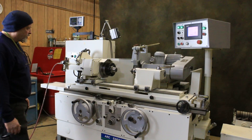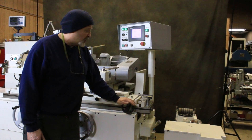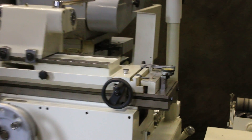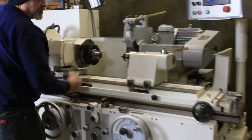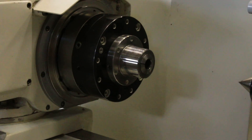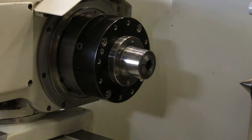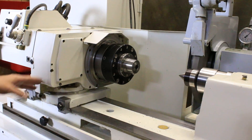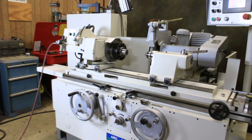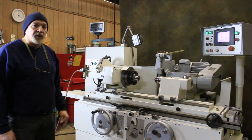It's very quiet, very nice, very clean. Over here we have a taper adjustment for the table to get the taper out — unlock the clamps on either side, and we have a dial indicator. Here you can see we have the 5C on the spindle nose — it can open and close, can be removed. You can put a chuck on it, you can put a regular center on it. The headstock swivels around 180 degrees. And that's your Chevalier CGP 1224 cylindrical grinder. Thank you.